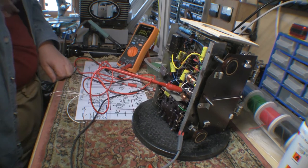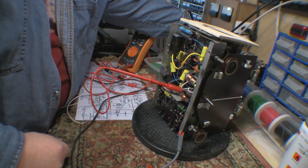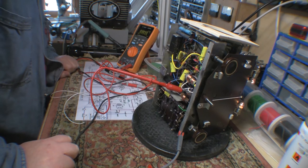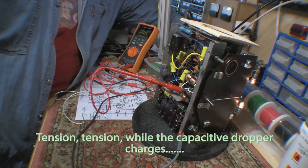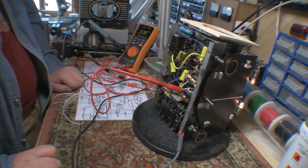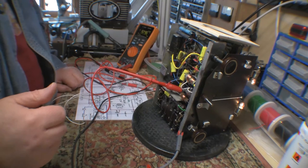So the variac is turned down to zero. You power it on. Give it about 50 volts here. And I see the dial bulbs have started to fire up. Current seems okay, there's no excessive current draw. You go to 100 volts. Okay, volts are cranking up. Turn up the volume here. Oops, I hear something. Okay, I got a B plus of 97.